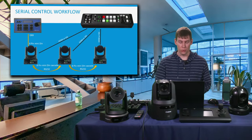The second tech tip that we wanted to say is that since you are using a network switch to make the devices communicate to each other, some network switches have the ability to provide power over Ethernet from the switch to the camera. So that's one less cable that you have to worry about.